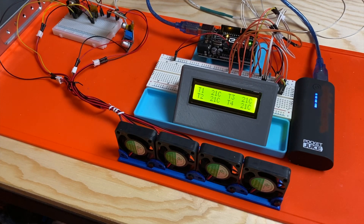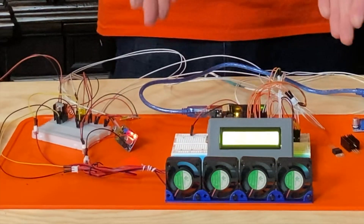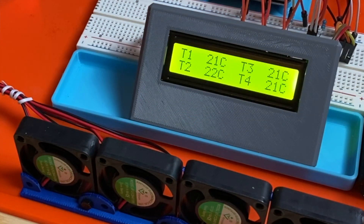Let's turn the test rig on. We're getting about 20 degrees C, which is room temperature. Then we turn on the 24 volt power supply and watch the temperature readings. On screen you see T1, T2, T3, and T4 — the four thermistors. T1 is the 7812 with the heatsink, T2 is the 7812 without the heatsink, T3 is the big buck converter, and T4 is the small buck converter. Right away we can see the 7812 regulators are starting to heat up pretty quickly, while the buck converters are warming up a little bit but not nearly as quickly. I'm going to speed up the footage and we'll see what temperatures we're getting after about 15 minutes.